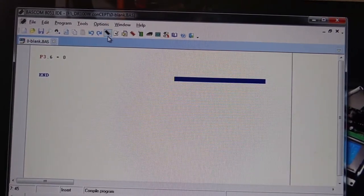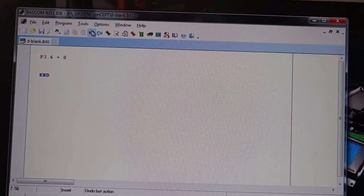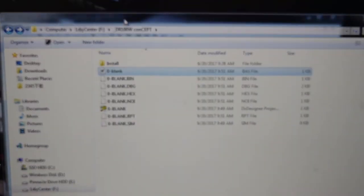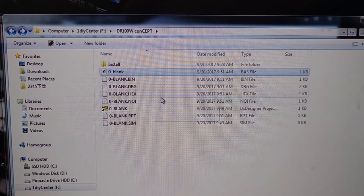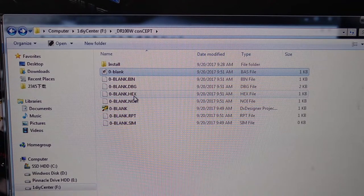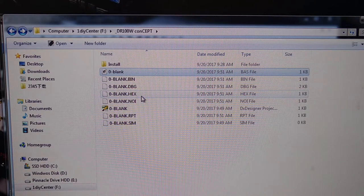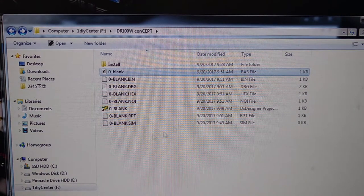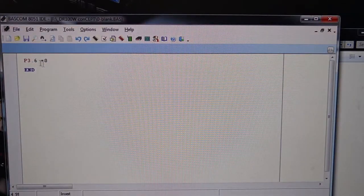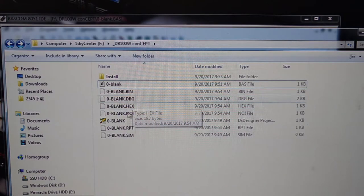Let's do that again — okay, that's the compilation. So after compiling, if you go back to your directory where your program is saved, you can see this is blank because we did not put any name on it. And we get the compiled bin and the compiled hex. The bin or hex is the one that we're going to download into the ROM of the microcontroller. We just take this file and later we're going to expand our understanding about it. Whenever we hit this compile button, it will generate a bin code, hex code, and other files.